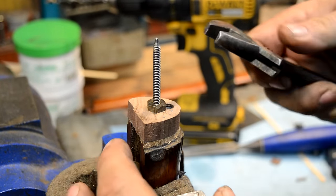The first thing we're gonna do here is clean out this screw hole. Now we got a little bit of breakout. There's a very, very thin web in between this screw channel and the top. There's not a lot of material here. And that just pops off clean because we didn't wet the surface. We don't have to peel any wood off. We can just very, very gently take this, and just nibble this off and then, see, that rides right off because it's not sticking to the surface because we didn't wet it. Now in the spots where we wet it, like back when we did the chip, we got it on both sides, it sticks really well.